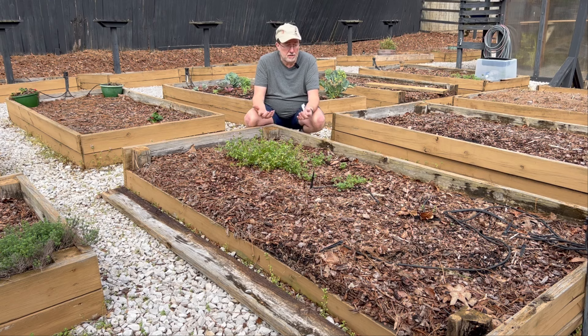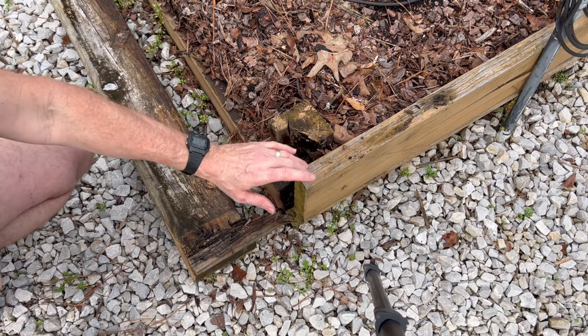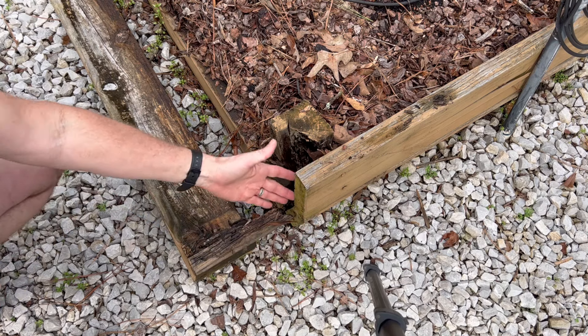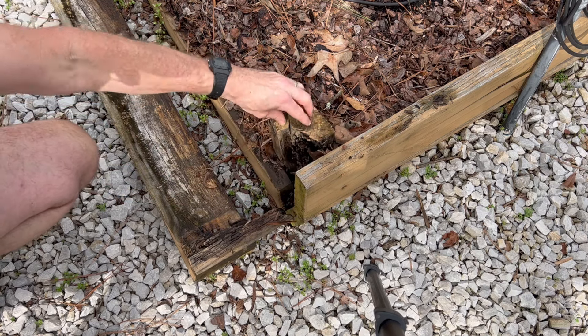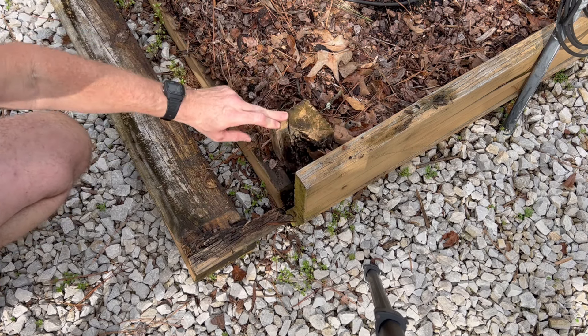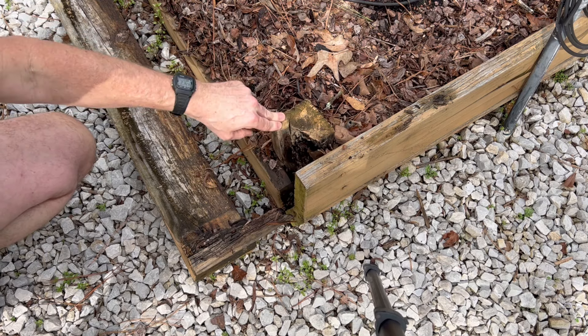It's currently 2024, so it's been a great garden bed, but it's just time to replace. They're starting to show their age and I'm starting to find a lot of rot. As you can see, this board right here is actually falling off. Originally on these beds, I used two two-by-sixes. Today I will be doing two-by-twelve boards where I won't have a gap. But this is how they were originally put together with four-by-four posts that just went a short distance into the ground. The problem is these have rotted out prematurely, and that was really my fault. I'll give you a closeup of how to prevent that.